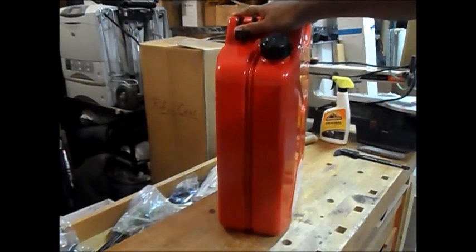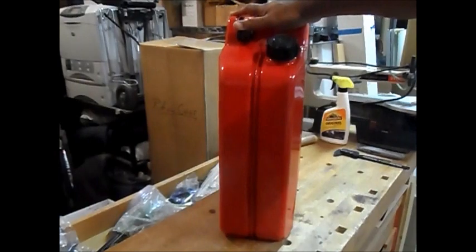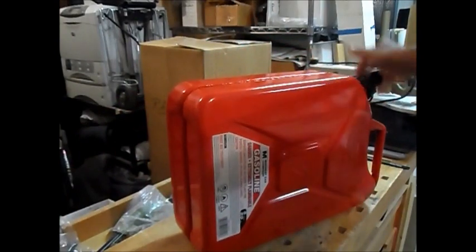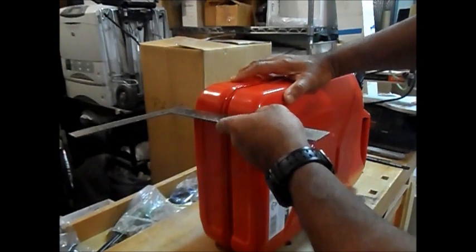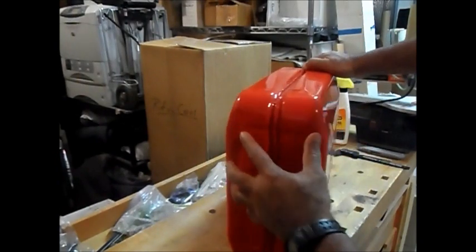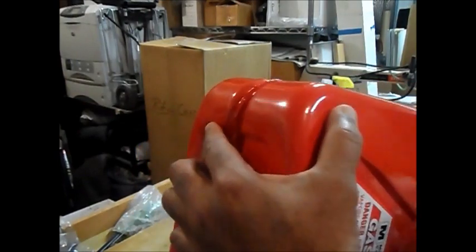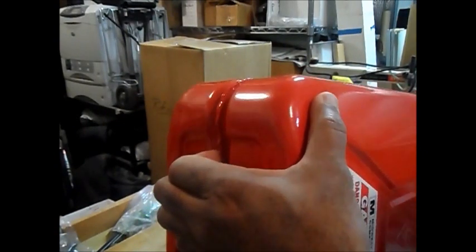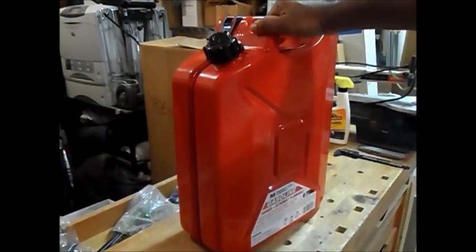The can rocks. I've seen jerry cans when I was in the service, and when they sit flush on the ground, they sit flush — they don't rock. Looking at the bottom as to why this one rocks, we have two issues: one, it hits the weld, and two, there's a little dent right here. Maybe if the reflection is right you can see it in there. So that's not really good.